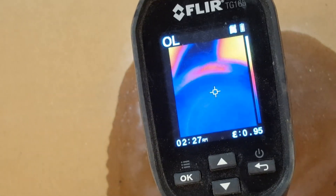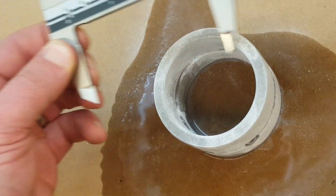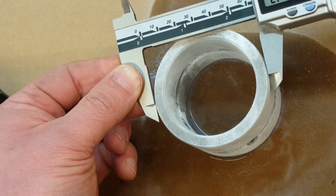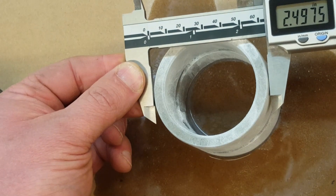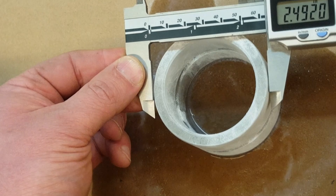You can see here with just a modicum — yeah, we're in overload. We have chilled down the part to the point where it is a full two thou smaller. Well, even more than that — four thou smaller.